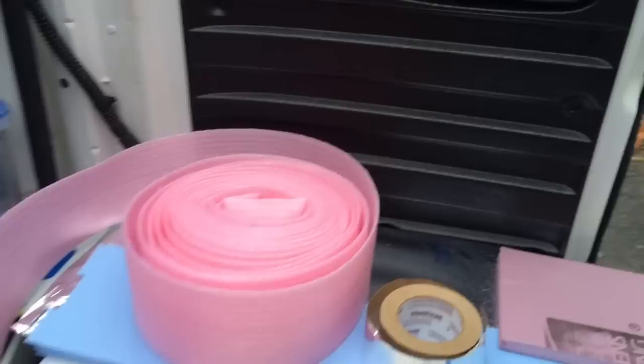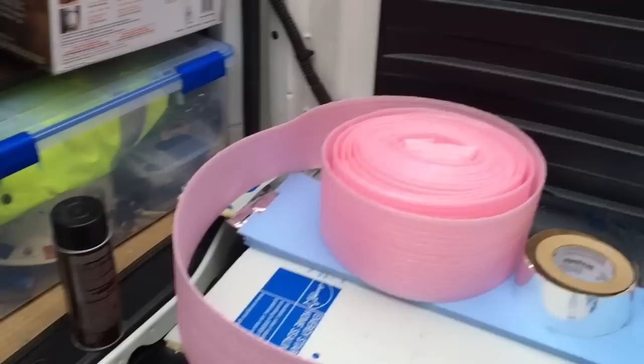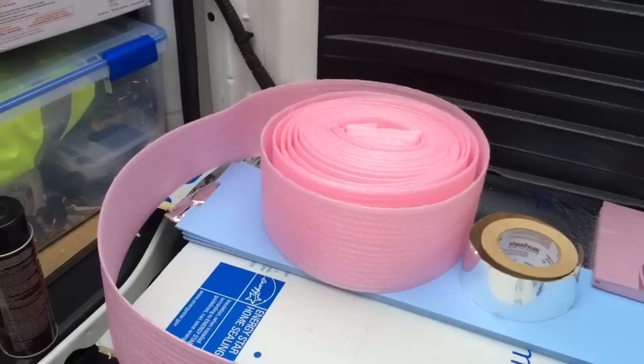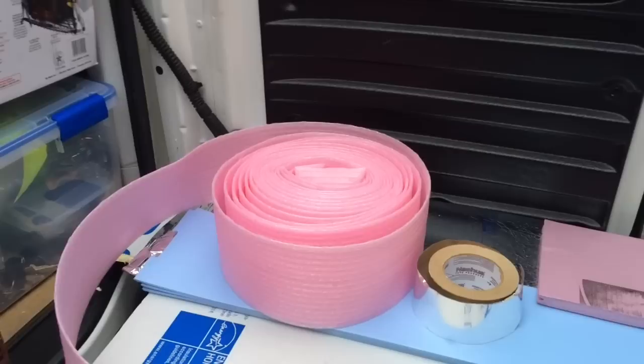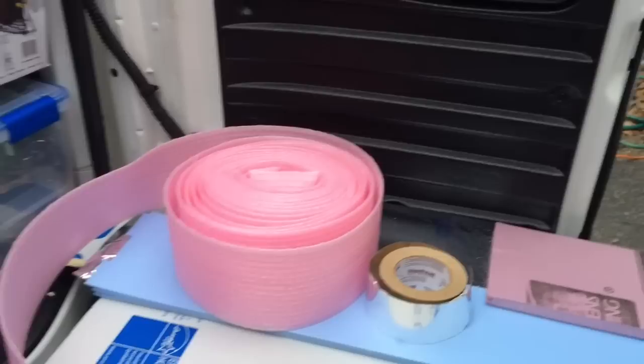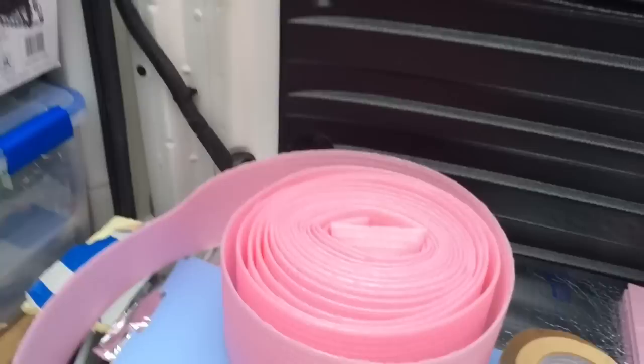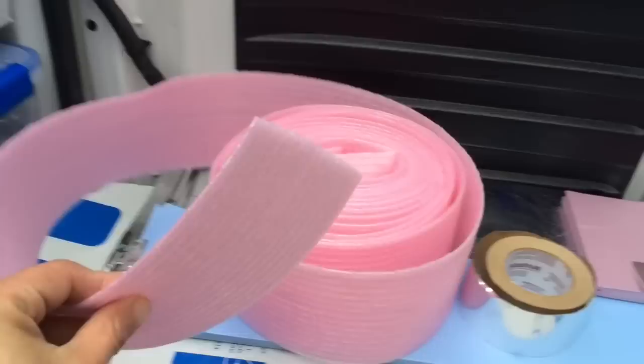When it came to the ribs on the ceiling, I wanted to insulate them but they only had these tiny little holes that you'll be seeing shortly, and I just couldn't find anything that I could fit in there. I thought of styrofoam peanuts — those little grains of styrofoam I could probably shove or blow in there — but the problem with those is they get statically charged, they start clinging to the metal, and they won't go where you want them to go. They just make a whole mess, so I didn't use that.